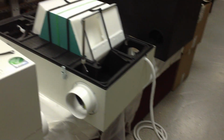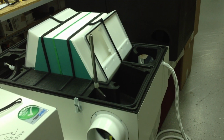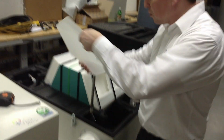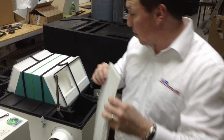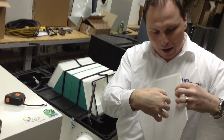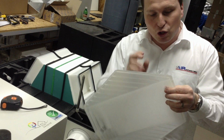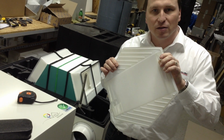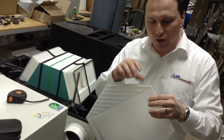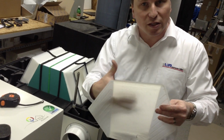Now I'm going to grab one very quickly. This is a sample. Oh, alright, I apologize. So this is actually inside. I already demonstrated to somebody, so it's turned up. But what we are actually causing is air traveling from outside, and on the other side, air traveling from the inside of the unit. Those two streams of air are separated by a wall only 53 microns thick. So the heat transfer is absolutely enormous. What happens when you have air from inside? It condenses and it starts to freeze.